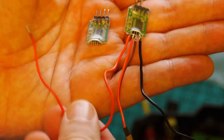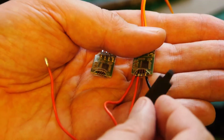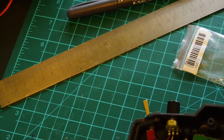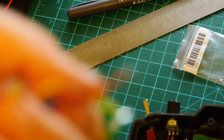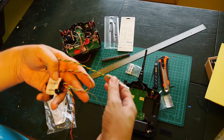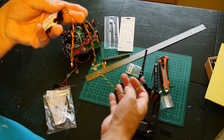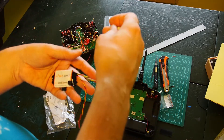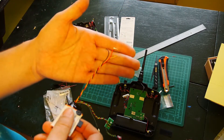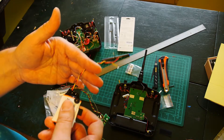So: red, free, red, free, black, and in the middle position is the servo female cable, or servo cable with female connector. We will use this module. Put switches on the body of the radio - it's the same as without telemetry, or with the first version of telemetry. Switches on the body of the radio. Antenna, of course. And these three wires we will solder on the back plate, back PCB of the radio. You can make them shorter.